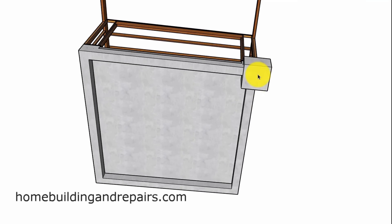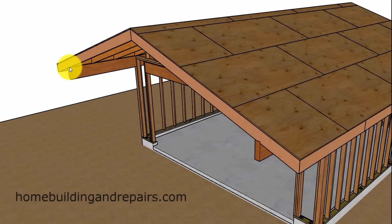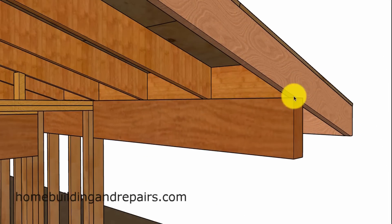Here's an idea of what it would look like from the bottom. In this example, I went ahead and brought the fascia board back, and it's sitting on top of the beam. You can see the edge of the beam is even with the edge of the fascia board. You can always bring this back an inch and a half — whatever the thickness is of the rafter or fascia board — and then you wouldn't need to notch it. You could just nail it into the edge of the beam. If the rafter is in front of the beam, it's also going to prevent water from seeping in, sitting on top of the beam, and rotting the beam out.